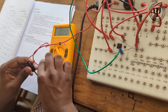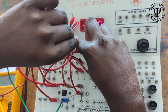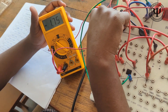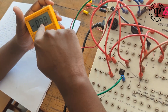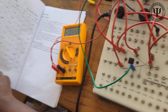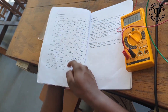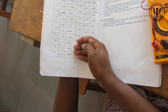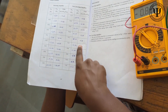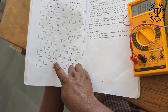To get negative input, just change the polarity of the multimeter and also change the polarity of the output connection. So there will be a polarity reversal. If you change the input to minus 0.8V, we are getting plus 6.9V as output. For the inverting amplifier, the gain should always be negative — it should not change sign. For non-inverting it should be positive. For inverting it will be negative, for non-inverting it should be positive.